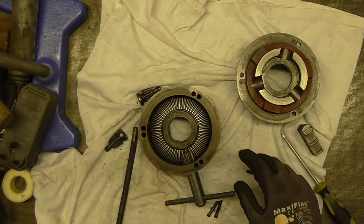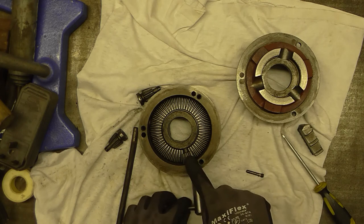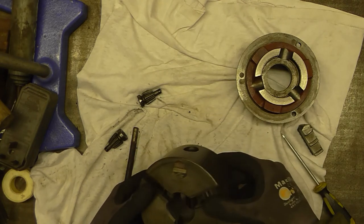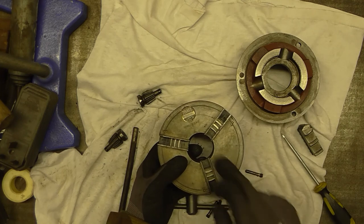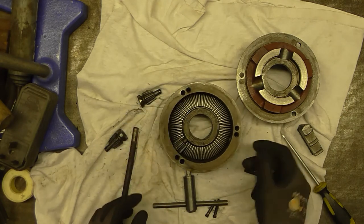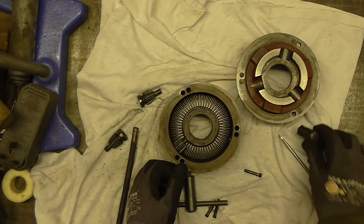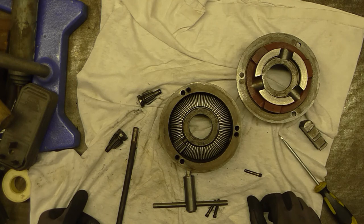When they grind the jaws and build the chuck they use one of the key positions as a master, and quite often the chuck body is marked with a master position. I'm told that if there isn't a master position marked, you use opposite the label as the position that was tightened. So whatever way it offsets the scroll should be consistent if you use that key position — and that's the position in which the jaws are ground, so that should give you your best centering.